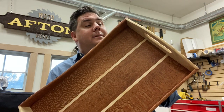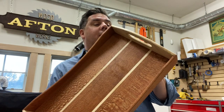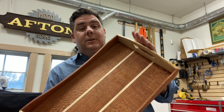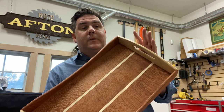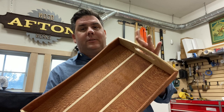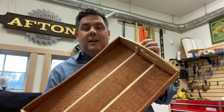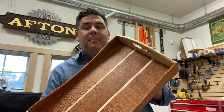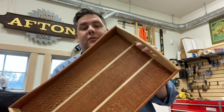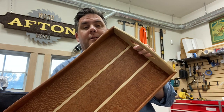Overall really happy. I think the lacewood is just spectacular and the bird's eye maple. I did finish it in Rubio Monocoat, which is the first time I've used that — it is a hard wax oil. Had never used it and it's really simple to put on. It might not be my new go-to finish; it doesn't have a ton of sheen to it, so just be aware of that, but it is soft and it just pulls the color out very nicely.